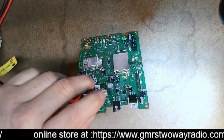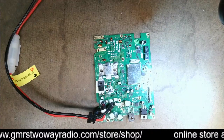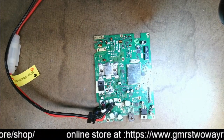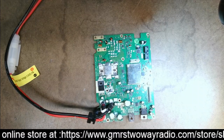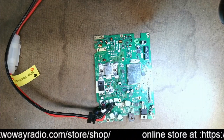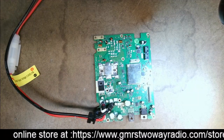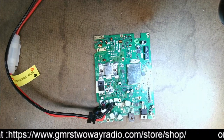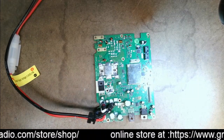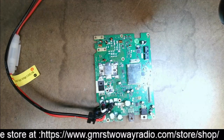You can do a quick visual inspection to spot the problem, though of course capacitors can fail in other ways that aren't visually apparent. That's how you quickly check without fancy equipment: do I have a bulged capacitor or not? If not, do I need to test further with an ESR meter? I hope this video was helpful. If there's enough interest, maybe I'll start doing some basic electronics videos. Any comments or questions, put them down below. Please subscribe — thank you and have a good day!